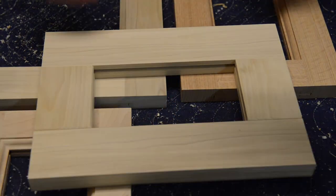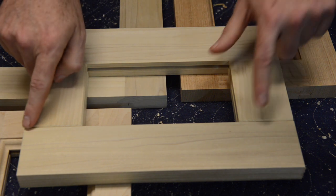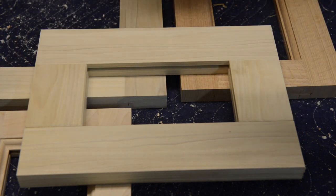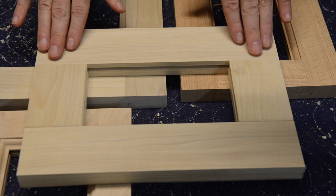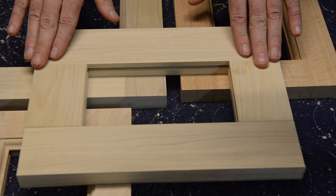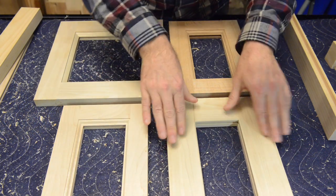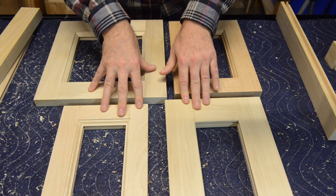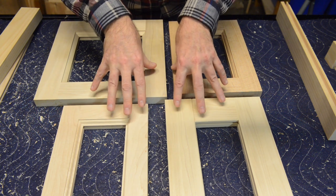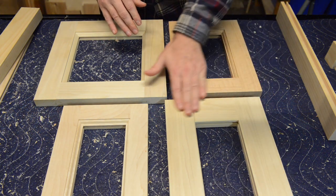Looking at the mission or square profile option, there's not a lot to see as it's a very simple style, but there are a couple of neat little variations on this one door. This is the V-joint option, and on one of the rails I have the chamfer running along the rail as well — on the other one I don't. The set is compatible with either approach. The cutters that make that V-chamfer can be positioned in a couple of different locations on the block, which allows you to make that V-joint across a really broad range of material thickness. None of these doors have had any finish applied; they're just mock-up doors to test out the set. The zero set functionality worked perfectly in both the fence setting and the spindle height — the only sanding required was simply to remove planer and jointer marks on the face. There was no sanding required to get the joints flush.